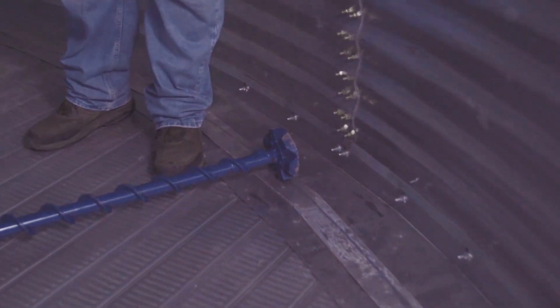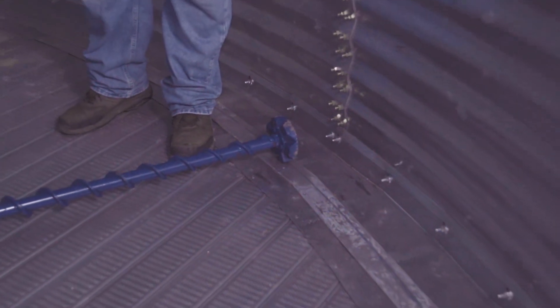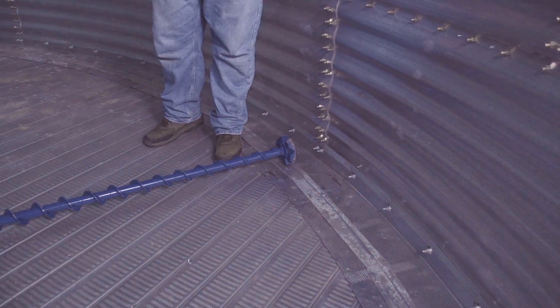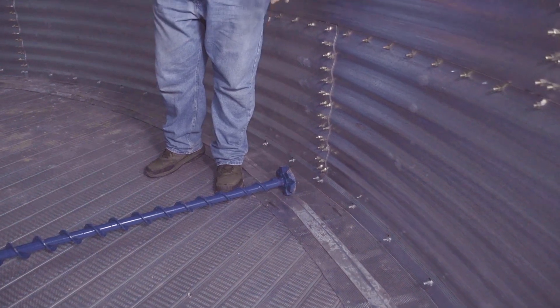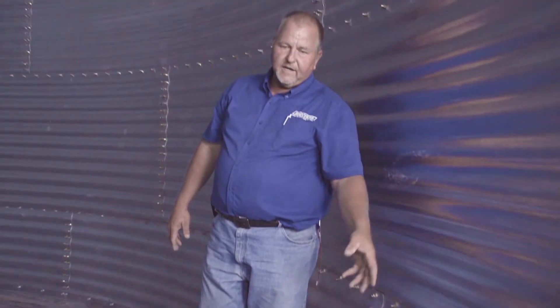The other thing is to come to the outside and look at the wear track. We want to make sure that all the rivets are in place on the track, that there are no grooves worn into the track, and that it's fastened down good and solid to the floor. We also want to look at the floor and make sure there aren't any excessive holes worn anywhere, or dents where grain can work underneath the flashing on the outer side.